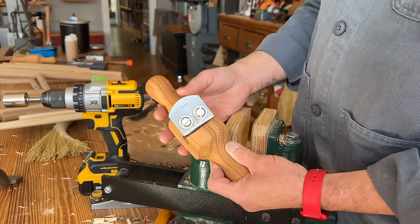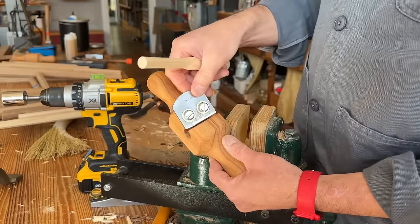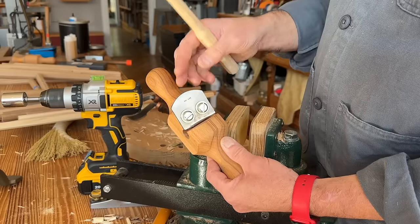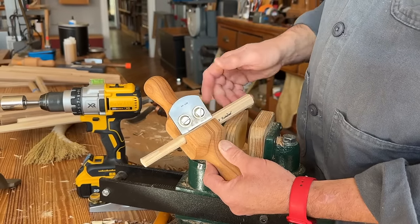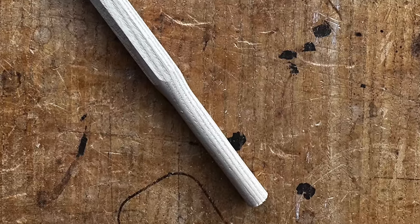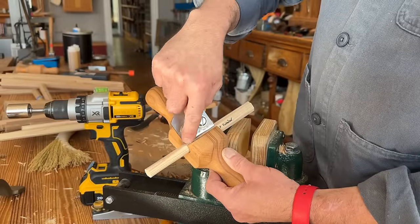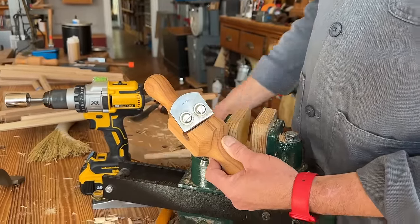There's a little bit more to it than that. One thing is that this has to be sharpened. After you use it and make a few chairs, you're going to need to resharpen it. So as soon as you get the tool, you need to run a stick through and then cut this off and save it, so that after you sharpen it, you can put it back in the tool and reset the blade so it's cutting right on the end of the stick. Save this stick and you'll be good.